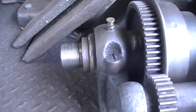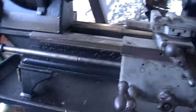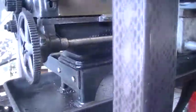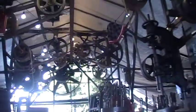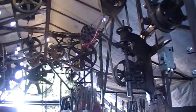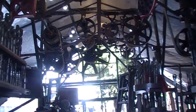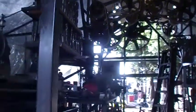I think that's going to solve a lot of my problems. This lathe had a lot more problems than I had realized. I made it work — when you chuck up a piece of wood like I did on the hubs, and you turn them down, as long as you don't take it out of the chuck or change anything, you can drill it out and get it concentric and get it fairly close.